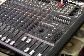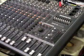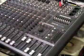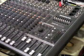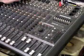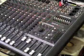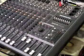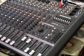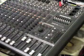Now again, something I learned, I was a bit nervous about until I knew more about it, but something I've learned now is that you can still use dynamic mics with the global phantom power switch switched on, engaged. You can still use them as long as whatever it is you're connecting to these sockets here is balanced. Then it won't be affected adversely by the phantom power. So you can use a mixture of dynamic and condenser mics on these inputs, engage the phantom power, and as long as your dynamic mic is plugging into the desk in a balanced connection, which most decent quality dynamic mics will, then they're not going to be harmed by the phantom power. It's only if it's connected via an unbalanced connection that you're going to have the problems.